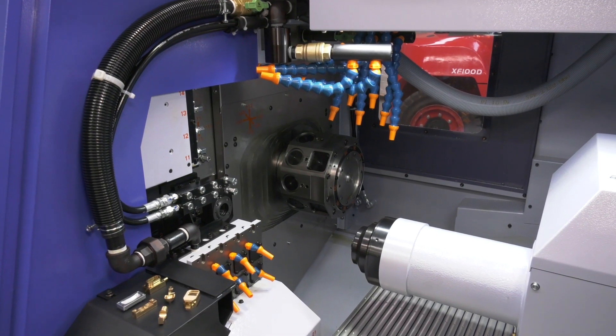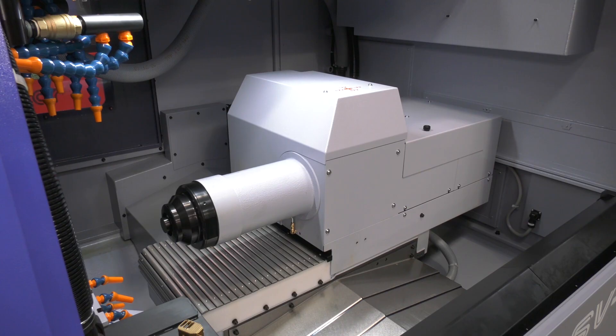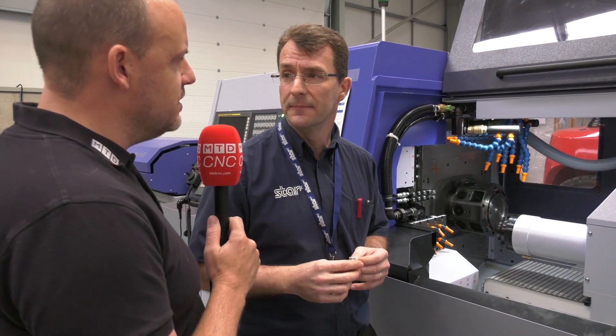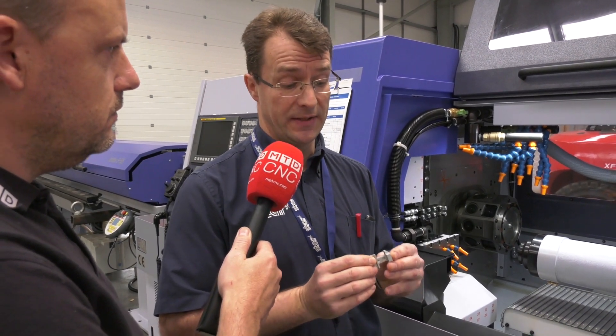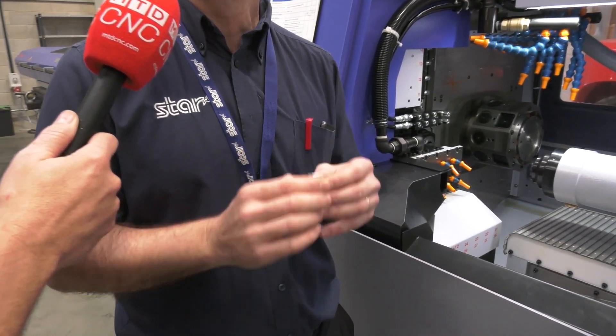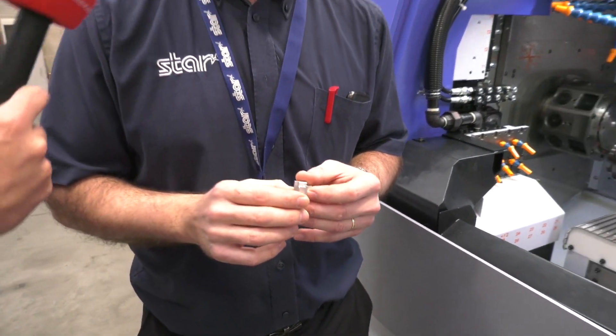You said most of the work is done on the first op, so the second op on the sub-spindle is just finishing? We're just going to qualify the back end on the sub-spindle — it is head-one-heavy in this case. Isn't that a disadvantage? Originally we did look at doing it head one and head two, machining in that orientation, but the customer can only get a certain diameter stock, which means we've got to machine it this way. With the turret and the platen we'll still hit the cycle time — we're quite sure.